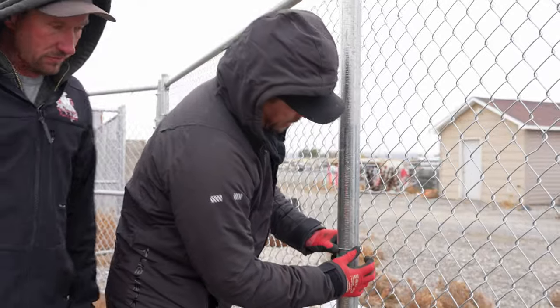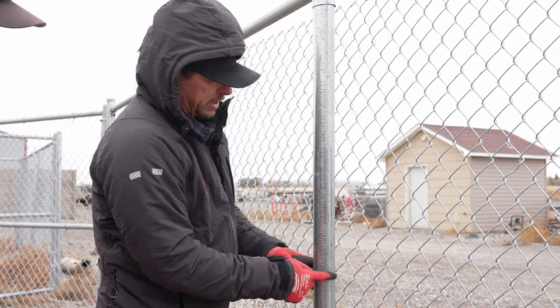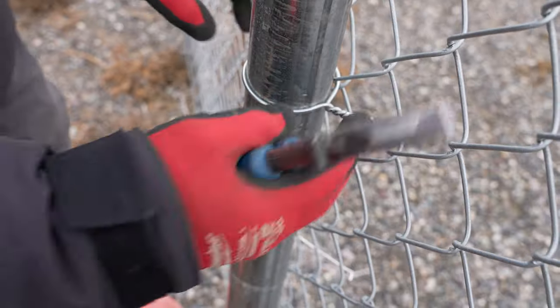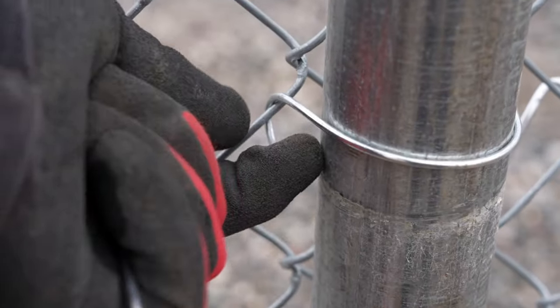Notice he didn't have the tail sticking straight out — he has the tail off to the side, which is incredibly important. Now when we're doing projects that are not security projects, say we're in somebody's backyard, we'll take this and tap it all the way back around to where it touches the chain link. We take the extra time so that nobody can ever come in contact with that. Typically these break off that way so we don't have anything sticking out.